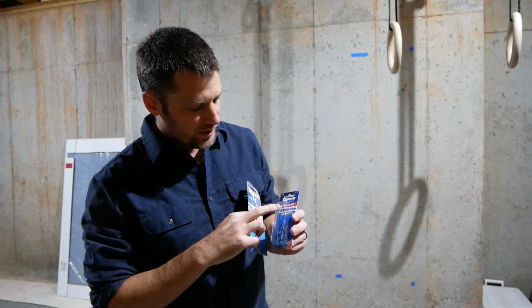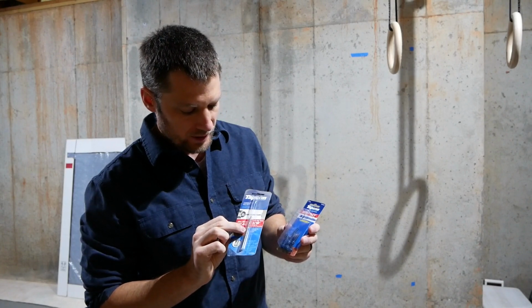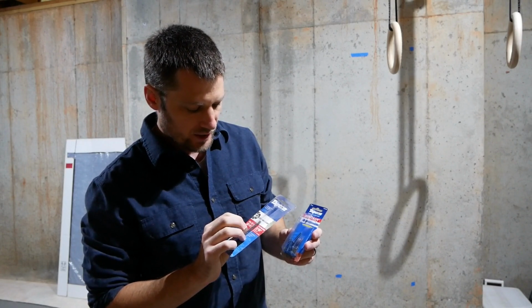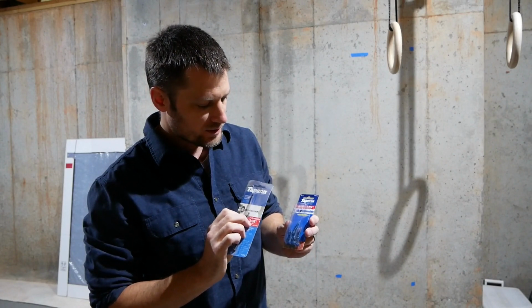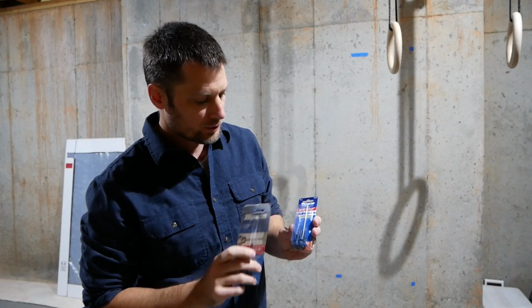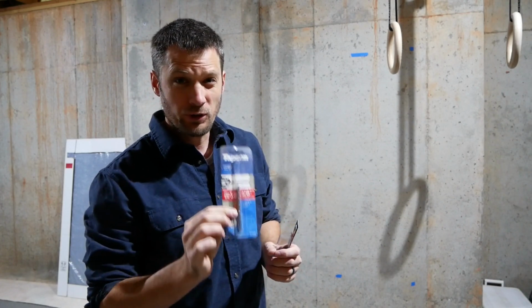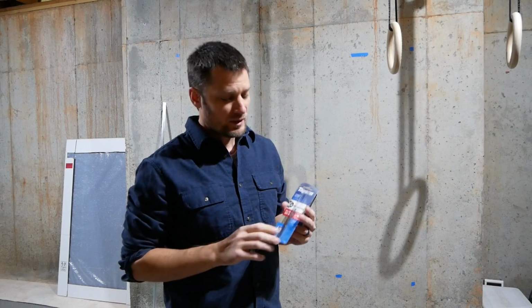And this says 3/16 by 1 1/4. And then right here on the bit it says this is a 5/32 by 3 1/2 inch. And this is for the 3/16 anchors. So you know that you've got the right size bit for these anchors here. And so really the best way to use this bit is to use a hammer drill. A hammer drill is going to just really help you get that hole really fast, but you know, if this is just a single project you're doing, you really don't need a hammer drill.